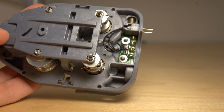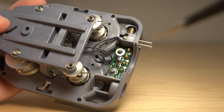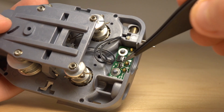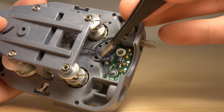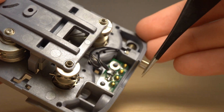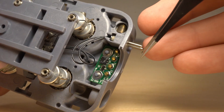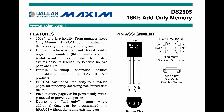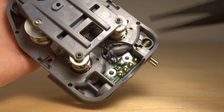Now that we're inside the device, we can see a couple of wires and a circuit board. The wires are for the cautery portion of the device and are not connected to the circuit board at all. The circuit board has a memory chip on it and a Zener diode for ESD protection. The four pins are: ground, one-wire communication for the memory chip, and two pins that are shorted together, presumably to detect if the device is connected. The memory chip has add-only memory, allowing the DaVinci system to enforce the 10-use limit. There is also a magnet embedded in the plastic, though I'm not sure what that's for.